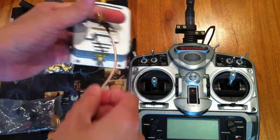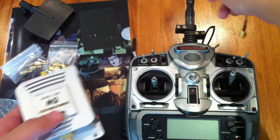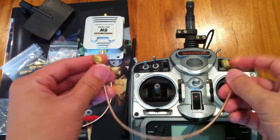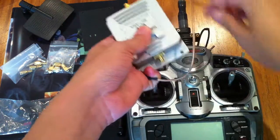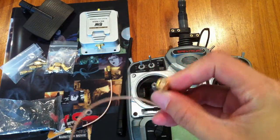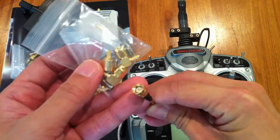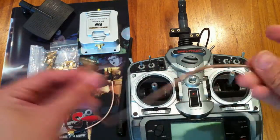The coaxial cable that comes with the booster is kind of short, so it's not long enough to go all the way to the source. What I've done is made my own extension cable — or rather my own link — which has the exact length I need from the source all the way into the booster. I made this out of RG316 coaxial cable with one SMA female connector crimped onto the cable, and the other end is the SMA male with the pin. You could make your own cable or buy a longer coaxial cable from eBay.